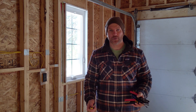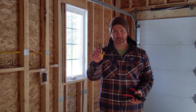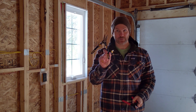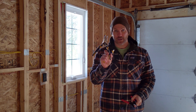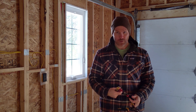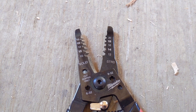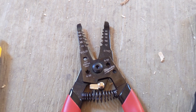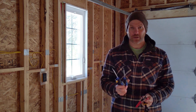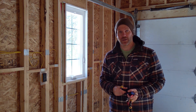I'm just going to go over the tools you need for doing an outlet like this. You've got your standard utility knife for stripping back the casing. I've got a good set of linesman pliers — basically for twisting grounds together and cutting wires, those are essential. Get your wire strippers — these are all marked on the ends whether it's stranded or solid wire and the gauge. And then I've got two screwdrivers: a Phillips and a flathead.